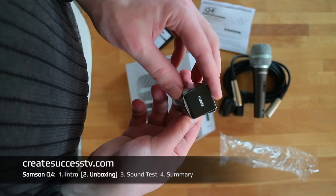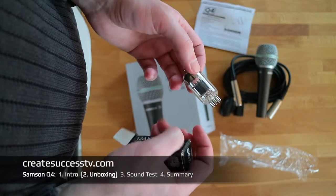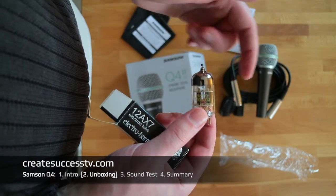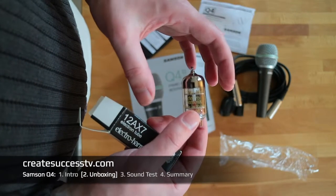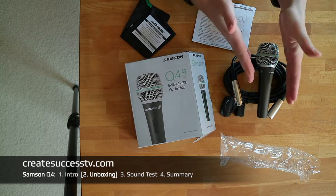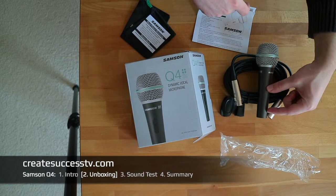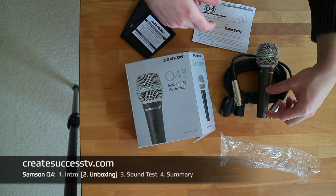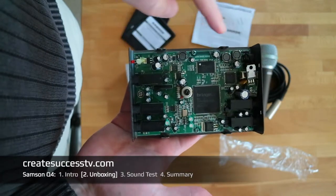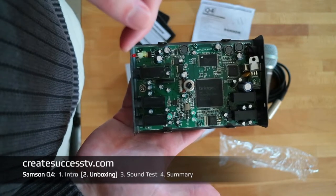This flexibility is something I really enjoy — mixing and matching, trying different combinations. For example, with a tube preamp in the middle between your mic and interface, you could even swap out the tube itself — Russian, Chinese, or European tubes all create totally different sounds. That kind of modification is just not possible with a USB mic, because a USB mic has to do all the analog-to-digital conversion internally with very little space and components.